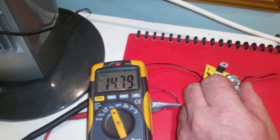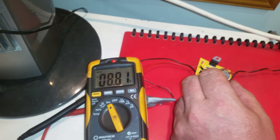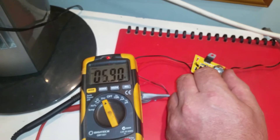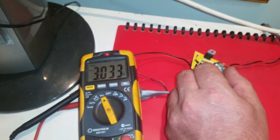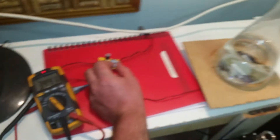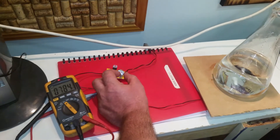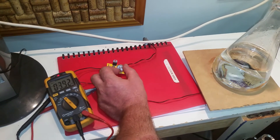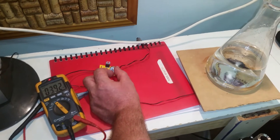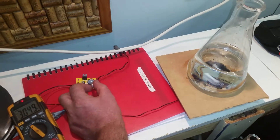That's pretty good, and you can see — if I put it on the meter and turn it down — you can see the voltage dropping there. I think it goes to about 1.2 — 1.26 there — which is not enough to fire up the fan. So it fires up at about 6 volts to get it rolling, but you can go down to about 3 volts, just under.